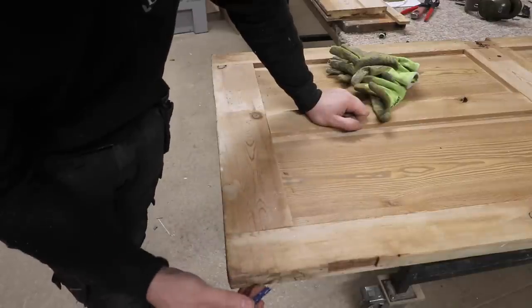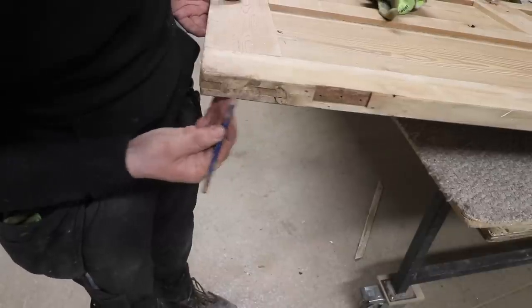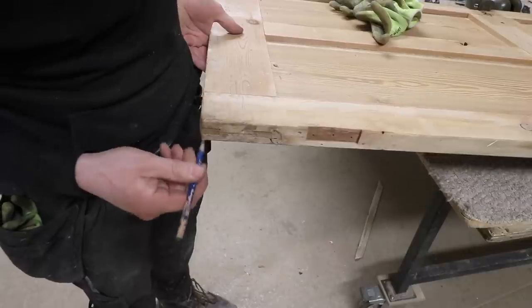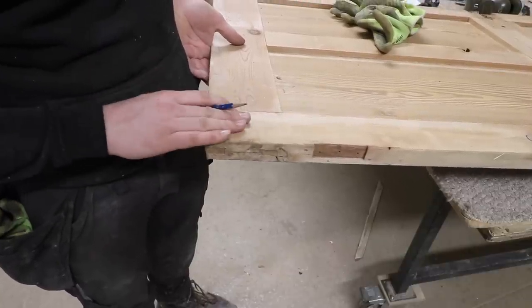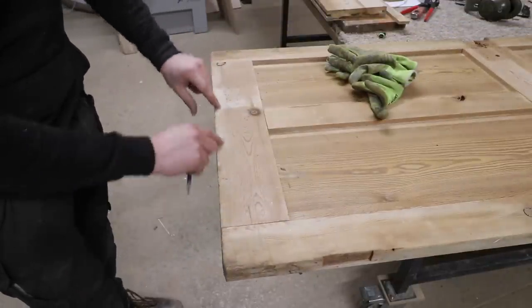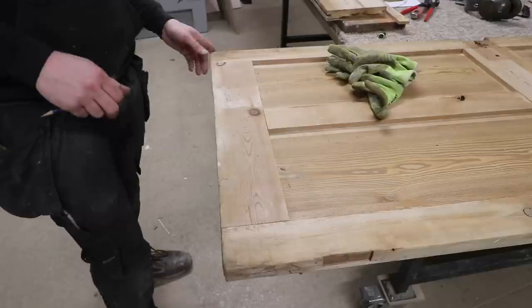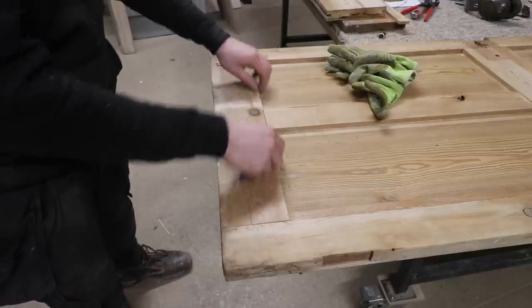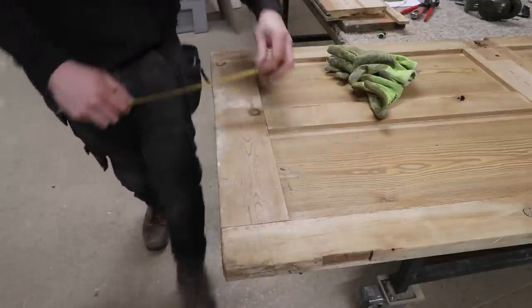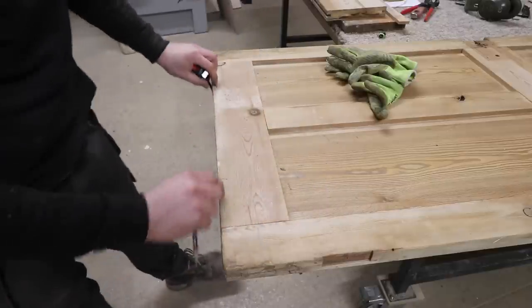I'm going to offset a splice onto these uprights — on one half of the door I'll trim it down in the middle, and the other side will be cut down lower, doing a halving joint to add that bit in. It'll be glued and fairly strong. Then I'll cut the bottom rail and glue a piece on in line with the grain, so all the grain runs in the right direction. I need to cut this bottom off nice and square, going to about 110mm to get a clean cut all the way across the door.